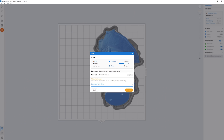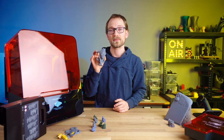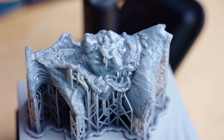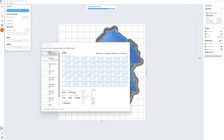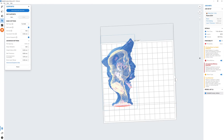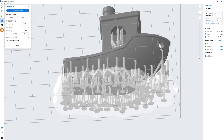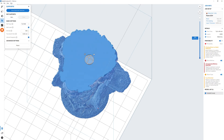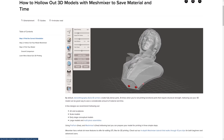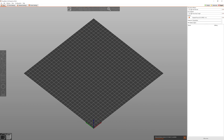Exporting was also quite slow, as it includes slicing the model and then uploading it to Formlabs' servers. With a complex model like the 3-million-polygon hollowed-out Salty McCready, you're going to be spending at least 10 minutes preparing the file with your CPU pegged for a large part of that time — it did make good use of all 24 CPU cores. On the upside, PreForm is a pleasure to use, with great visualizations of critical areas and small details like fading out the brim as you look at your parts from the underside. I'd like to see a hollowing feature for artistic models, though — Formlabs recommend using MeshMixer for that, but I used PrusaSlicer with a fictional large-volume SL1S profile because you can easily export the processed STL files from there.